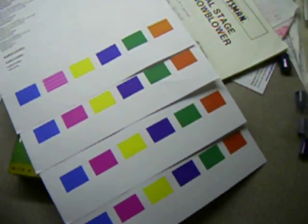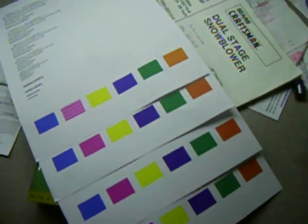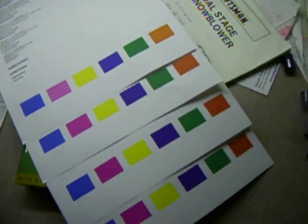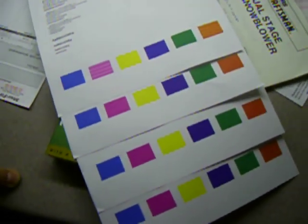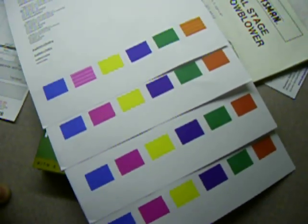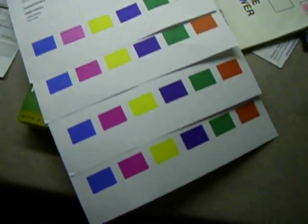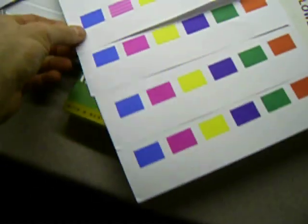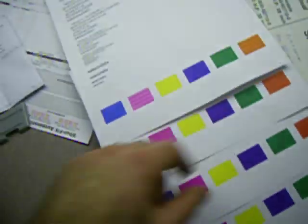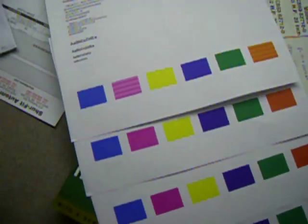I got the thing all back together and it was fine. However, I did nick one of the traces when removing a capacitor — I scraped the coating off the trace. The copper was fine but the protective coating got scraped off. To prevent it from corroding, I used some clear nail polish from my wife's makeup drawer. Make sure you do not use colored nail polish or anything with metallic fleck — clear nail polish only — and that will prevent the copper from corroding if you scrape the green protective layer off the trace.